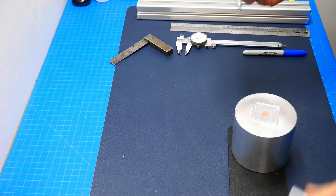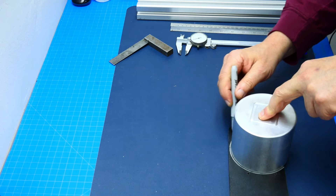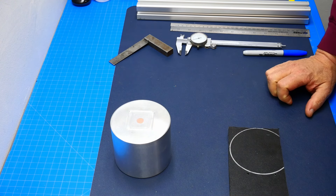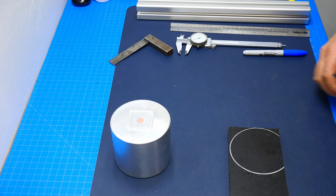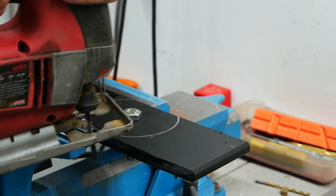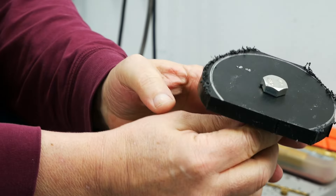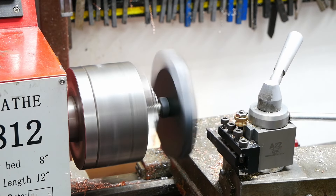This piece is not large enough to fit over it, so we're going to make kind of a three-quarter ring. First I'm going to draw this up and see how it fits best. We could cut some of those corners roughly with the jigsaw, make a hole to mount it in the lathe — because again it's too large — and then go from there. We put it in the lathe and now we're going to see if we can get something round out of that.